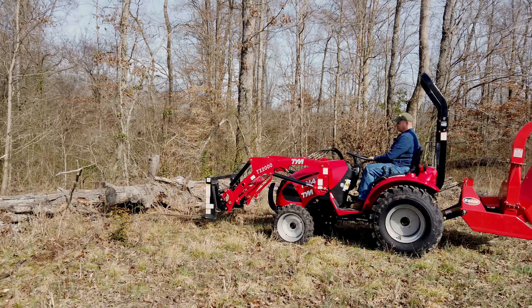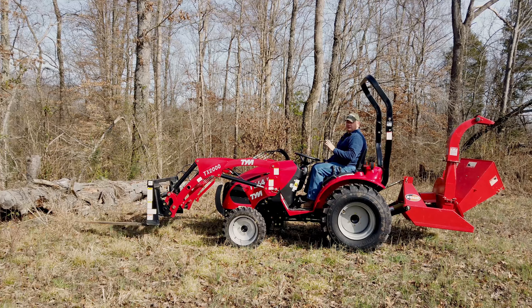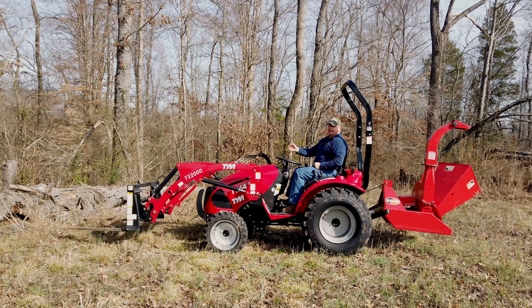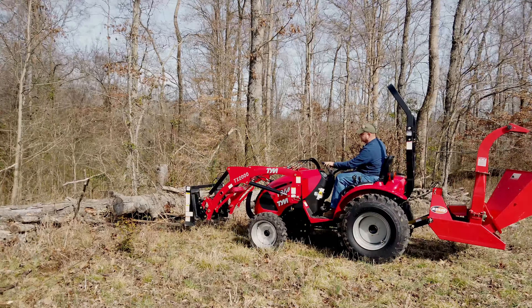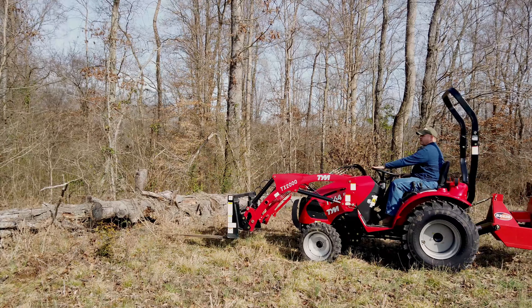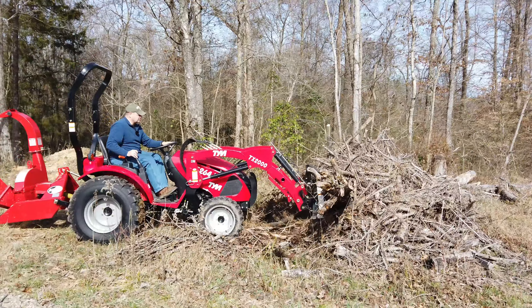That tiller's about 700 pounds. A ballast box is going to be very much necessary — you can see it picks the back end up. A ballast box and probably loaded tires will be needed. This is a heavy tractor, but what I'm telling you is the loader is just that strong. This thing will lift almost 1,300 to 1,400 pounds, 19 inches in front of the pin — basically the end of your bucket — that's where it's rated at. Generally it'll probably lift more than that because they always underrate loaders. I get the suspicion that if I had enough weight on the back end, this tree might actually move. I'm picking it up a little bit.